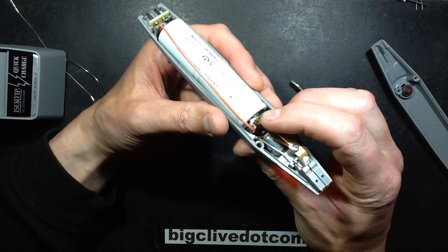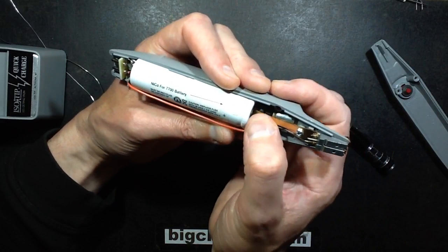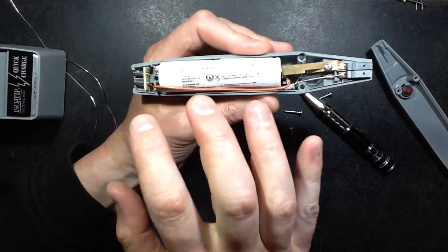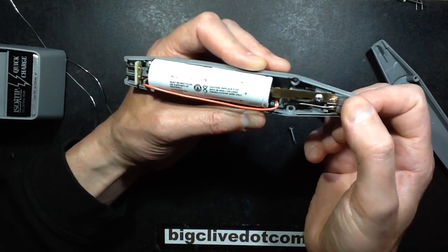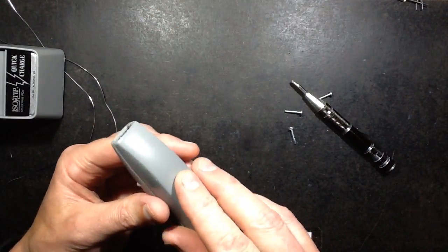This brass strip, it's also quite interesting that it's got a contact, just a section bent down and touching on the side of the lamp housing, just keeps it very simple. And then after that it's these huge chunky output terminals, so really there's not much to it. It's batteries, this big heavy springy contact, the lamp holder, and then the output terminals, so nice and simple. Not really much to go wrong, and actually quite serviceable.